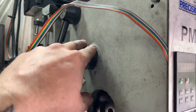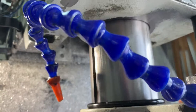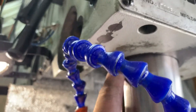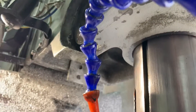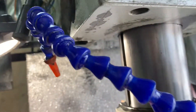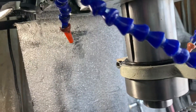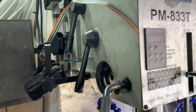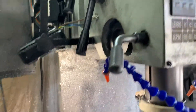I'll probably fill the head with epoxy granite up to about here for more rigidity and less vibrational chatter. I measured and it looks like I could put a 3.5-inch ISO 30 spindle in here — there are some Chinese models out there. I'd have to bore it out to about 3.6 inches, but there's still enough casting to mount and support it. I've got a few steps to do — I also have three other mills, a lathe, a router, and a 3D printer, so there are a lot of projects going on.